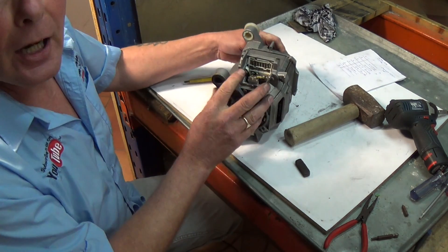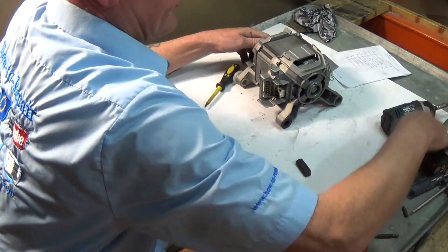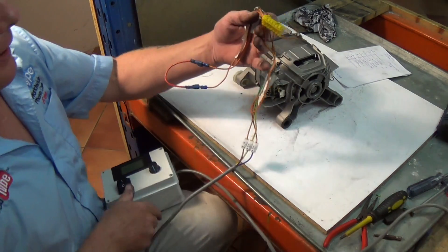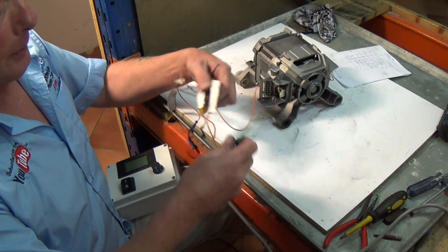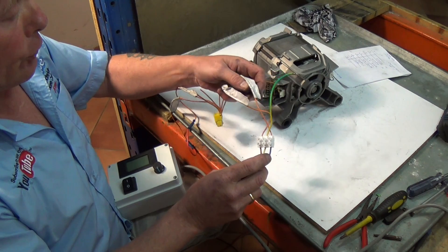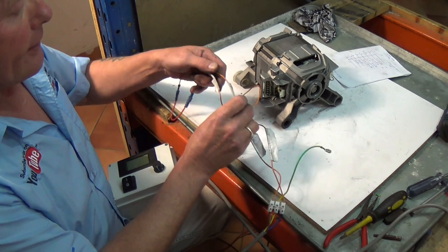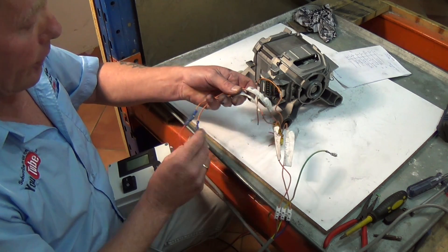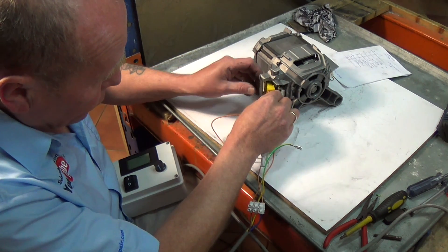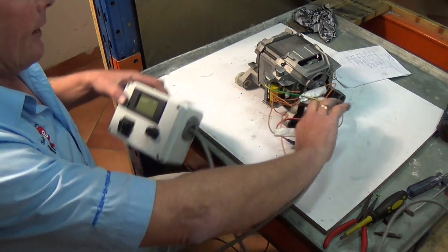It's very important that these carbon brushes slide evenly on the holders. That's all connected up and now we can connect up the test system again. There is a detailed video on the website but briefly: we have live and neutral. Live goes through to one of the field windings and the carbon brush on the other side is looped - this gives us our field. Do not try this unless you are competent with electrics and fully understand what you are doing. Always make sure you connect the earth. That's ready and set up.